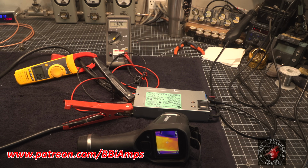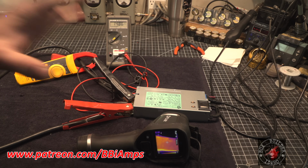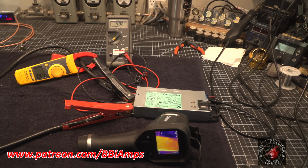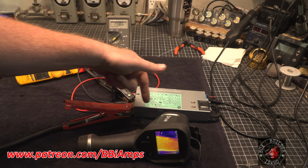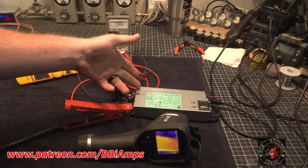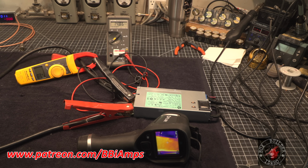The other problem I always had with using these is that this little jet blower fan in here would run at full chooch all the time. So imagine if you turned on your power supply 24/7. You'd pull your short curlies out. By changing one resistor inside this unit, actually adding a resistor on 2 little solder pads on a board that runs down this side, it goes to a self-regulated unit. There's a thermistor or a thermometer or whatever in here that gauges the temperature of the unit, and the fan regulates itself via heat. So until the unit gets to about 115, 120 degrees, this is how much noise it makes.